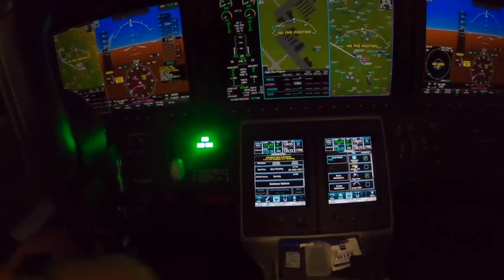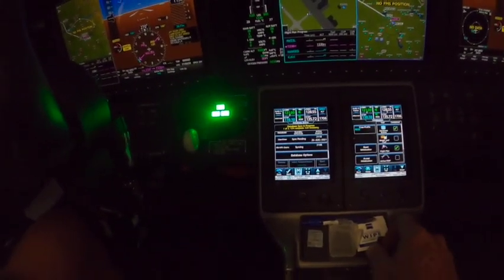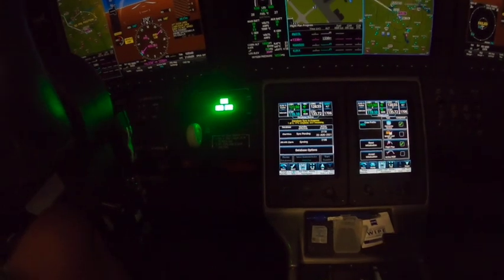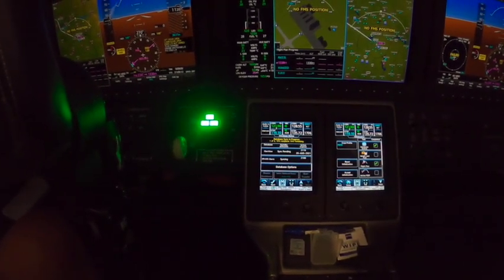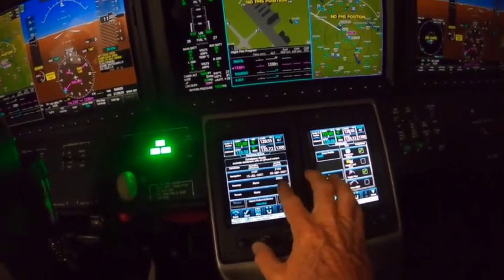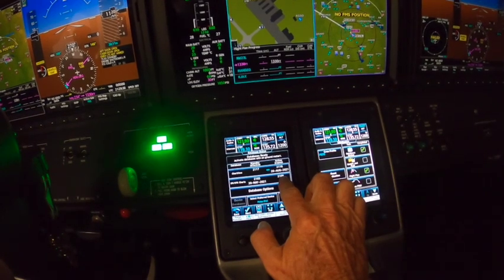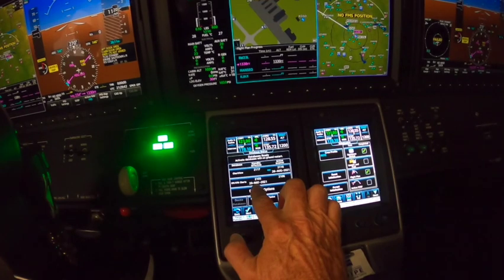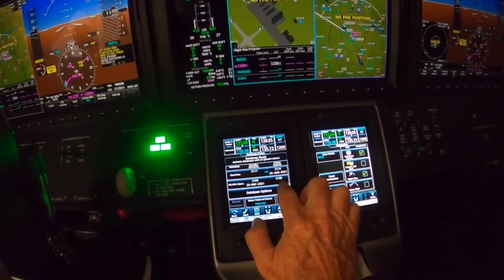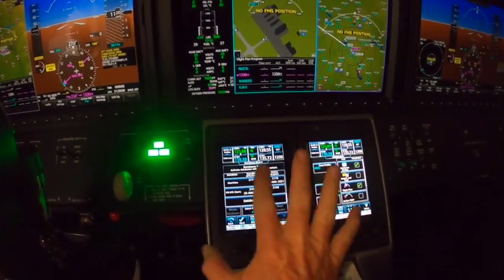All right, we're going to let this go again — it's counting. Hopefully this one goes a little faster. All right, here we go — databases are ready, activate databases on the next ground restart. All our dates are good. You can see on our final one that we just updated. Right now we're on the 2105 active, it's effective, and the new one is in standby — May 2021. This is the one that's going to activate tomorrow. It starts today on the 20th, so it won't update until tomorrow when I reboot. That's how you do the chart update, and I've got my connects card back in.